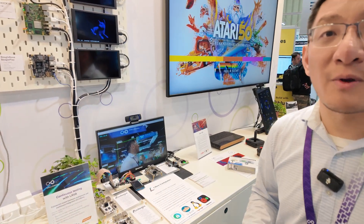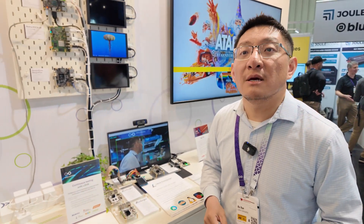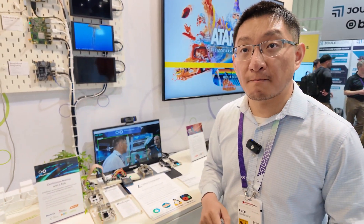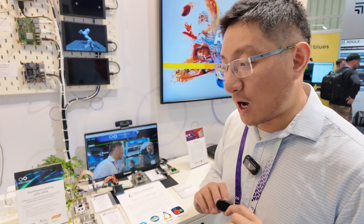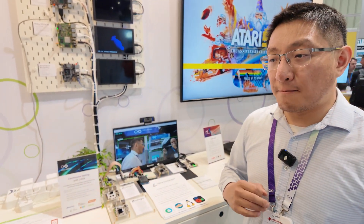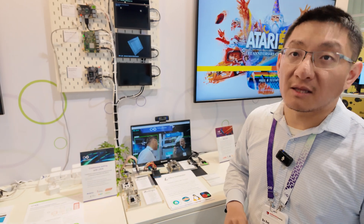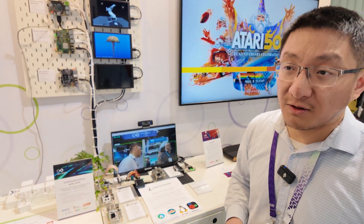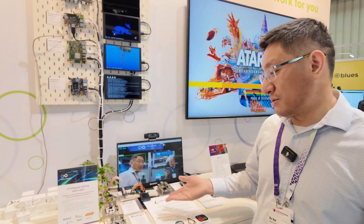On our boards the Linux kernel gets updated every week. On some other images you download off China servers, they're never updated — they introduce software security problems into your product pipeline. With us, everything is open. It is automated testing. We have a testing rack where we deploy all of our boards. We rebase off mainline Linux stable. Every week when Greg releases from the stable tree, we take it, deploy all our boards to test in a continuous testing environment, run other tests against certain hardware, then package it up onto our Debian server and release it to all customers.